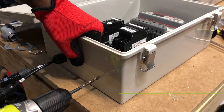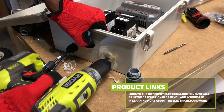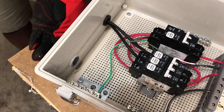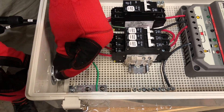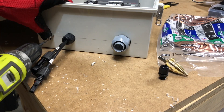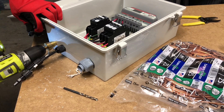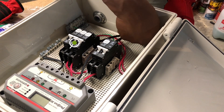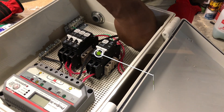After mounting the solar panel, I spent some time researching the proper way to install some of the electrical components and different breakers that may be needed to increase my knowledge in this area. There are still some things I need to learn since I'm still in the testing phase, so I will not be going over all the details of my electrical circuit. Please understand that the content in this video is not intended to substitute professional advice — always seek the advice of a qualified electrician for any questions regarding electrical or solar work. I also ended up using an upgraded solar charge controller with a built-in display screen showing battery status, incoming solar amps, and other important information. The breakers are primarily used for overcurrent protection. To help reduce the chance of my solar system causing a fire, I used a ground fault protector device made by Midnight Solar since my charge controller does not have one built-in, and the NEC requires it.